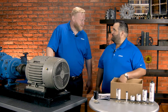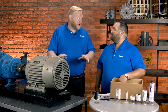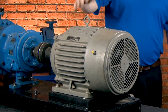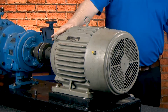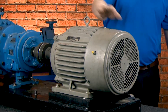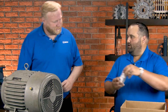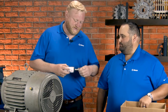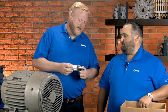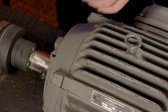And it sounds like you've already done this as well. Yeah, I was actually looking at it when you walked in — they've got a good little breakdown of exactly where and which type to use. So for this application here, we're looking at a very common 25 horsepower motor running about 3,600 RPMs. For the inboard bearing — it might be a little bit different from inboard versus outboard — but for the inboard bearing, we spec'd out, based off of their information, a 125. So we'll take the 125 greaser and attach it to the bearing housing on the inboard side of the motor. Exactly right. We've got a couple of other things we're putting on here — an adapter itself as well as an extension.